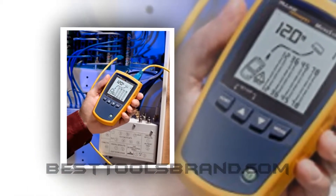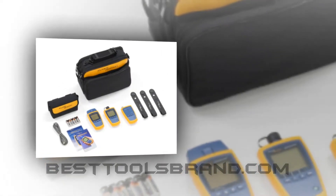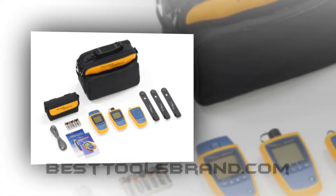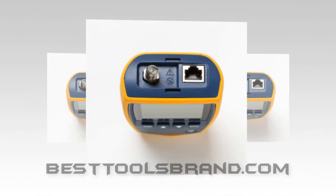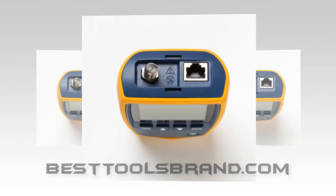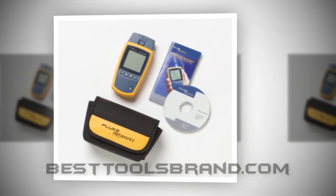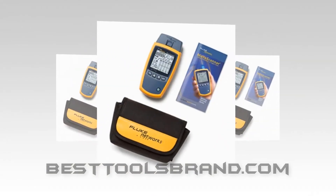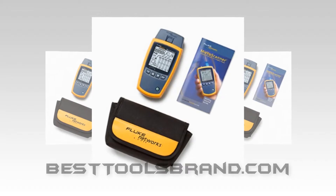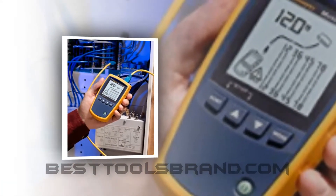An interesting thing is that among the included set of tools, you can see the MS2-100 tester, which is the best selection of our list. The Fluke Networks FTK 1000 Fiber Optic Cable Test Kit comes with the Simply Fiber Pro Optical Power Meter, which is great in calculating the power as well as loss through the double wavelength test. It concurrently transmits 1,300 nm and 850 nm wavelengths for cable verification in multi-mode fiber networks. In addition, it's well known for top-notch and accurate length measurement capacity.